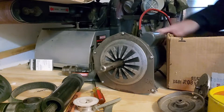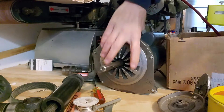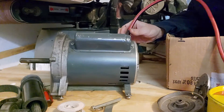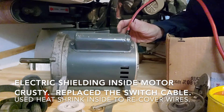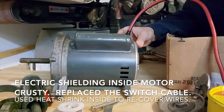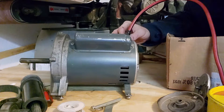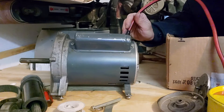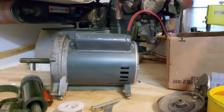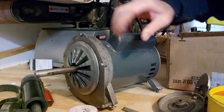When I bought the machine, everything is all inside — it sounded terrible, but I bought it anyway. I looked inside the motor and found that this wire was in terrible condition. I don't know if that was how it came from the factory, but it didn't have much of a stop here and the shielding inside was worn to where if anything moved, it should be able to arc. So I got in with some heat shrink tubing, shrunk that up, and rejoined it to a new head. Even if things look good on the outside, it could be fairly bad on the inside.